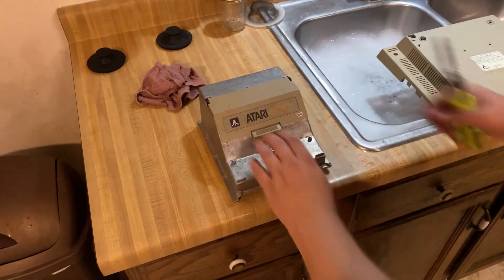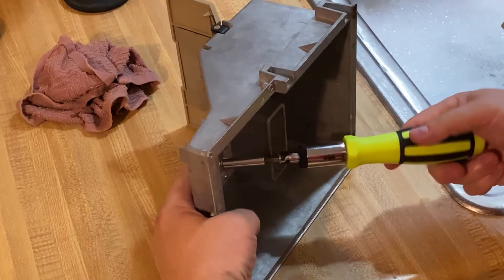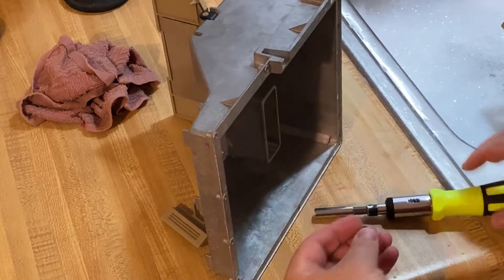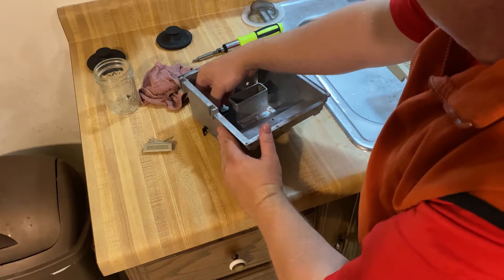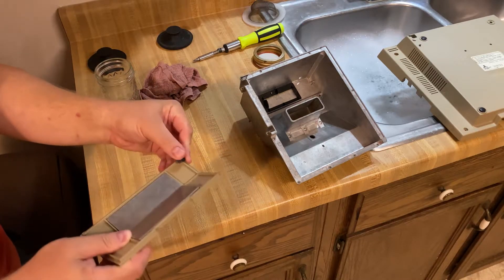There's the outer case compared to that lid, which I haven't finished scrubbing yet. Now it's time to take the lid apart. The catch here comes off with just the tip that holds bits — not even a regular screwdriver — just like that. The lid is spring-loaded, so I was careful taking it off. I removed the two mounting screws from the hinges and — snap! Oops! I didn't lose the spring fortunately, but the hinge went flying. I was able to recover it, however.